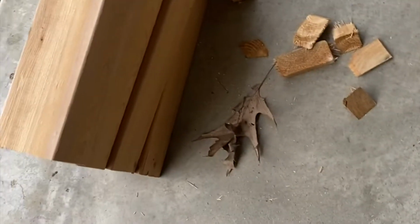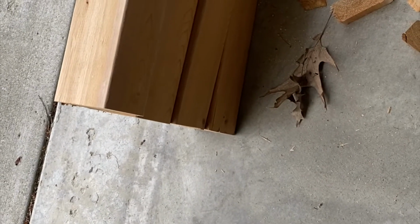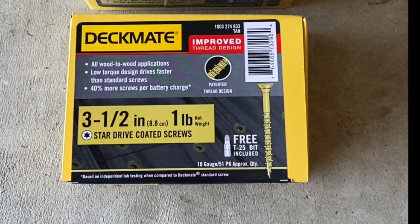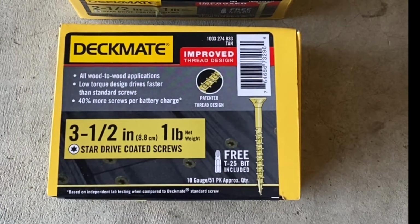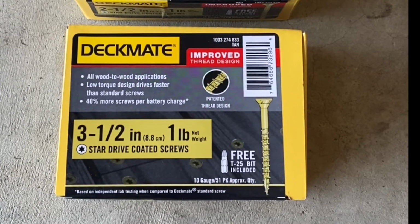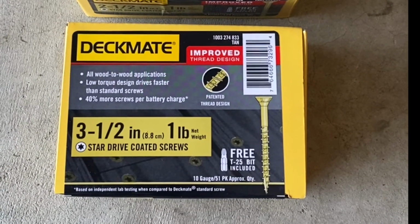Additionally, I use red cedar 4x4 timber, and I cut those at 18 inches as well and use those for all of the corner posts. I prefer to use exterior coated decking screws, but you could also use lag bolts or other hardware options that are rated for exterior use. I always advise drilling pilot holes prior to installing screws to prevent any wood splitting near the edges.